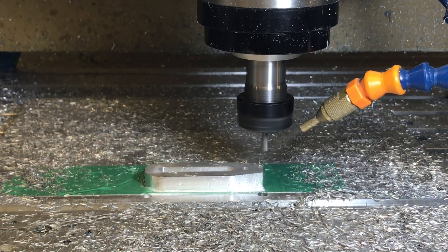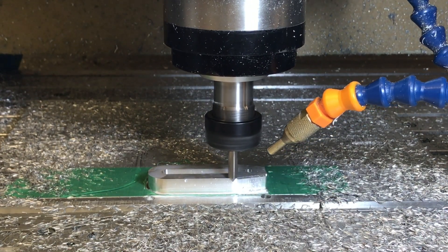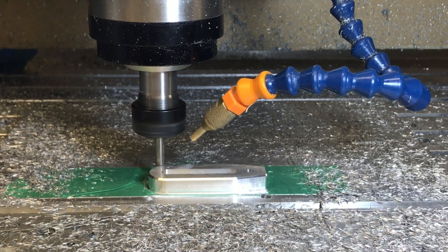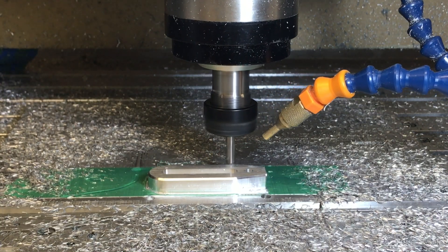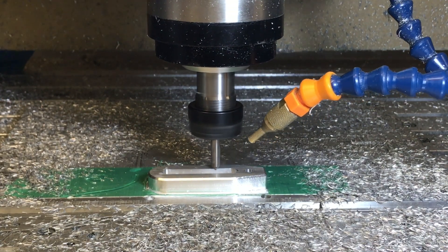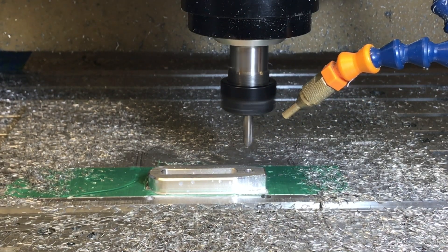Contouring is done, and I'm happy with that. Then I change over to the countersink cutter, which is a CNC spot drill — they're very versatile. Just coming off the tip like a mill on offset so they get a bit more surface speed, otherwise it's a bit stressful on the cutter. It came out pretty nice. I hadn't used the chamfer function on Fusion before — you use the contour, select the cutter, and it kind of figures it out for you. The outside had a larger chamfer, I think 0.5mm or 1mm, and then 0.2–0.3mm chamfers on the other edges.